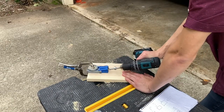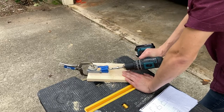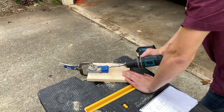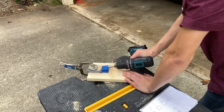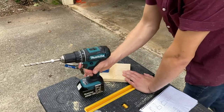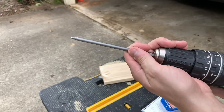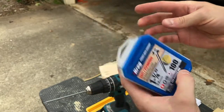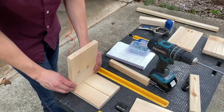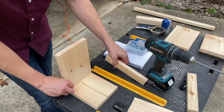For these larger pieces there are actually two pocket holes on the jig, so I ended up doing both for the wider spaced boards. When it's time to assemble you just switch to the driver bit, and I'm using one and a quarter inch length screws. Kreg screws also differentiate by wood type—this is a soft wood.